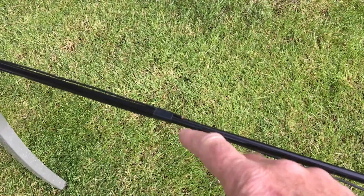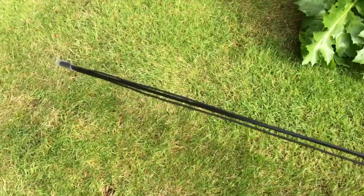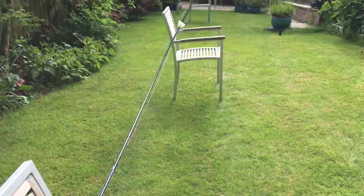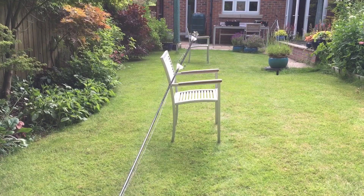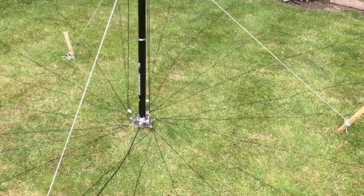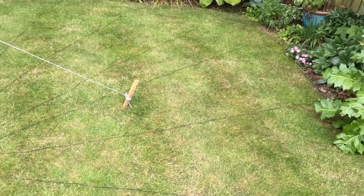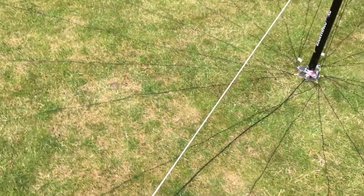That's the end of the current foldback before tuning. A bit of plastic tube just to keep it nice and tight, and a little bit of tube on the end to fasten it off. So that's the Expedition already set up. Now to put it on its base with the radials and see how it performs. We're ready to test - you can see the radials are laid out. A handy tip: the ends of the radials are about 110cm apart, because you lay them out and then find you've got a gap and have to go around again. You can see the coax attached, which is a free radial, and that goes back to the top of the garden - that's 17m of coax, just representing what I'll be using out portable in the field.